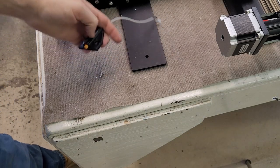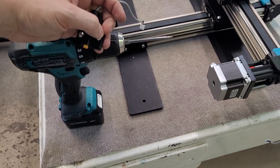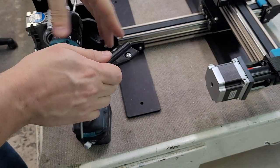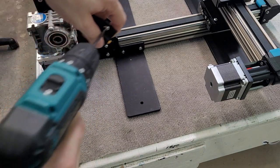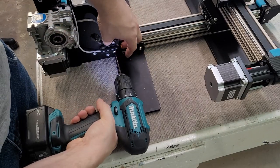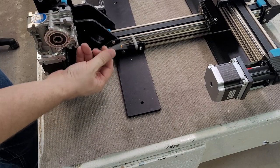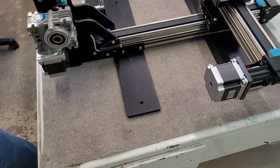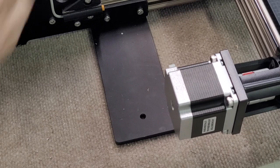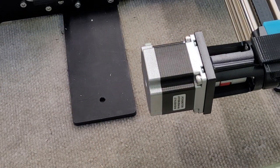All we have left is to put the Y-probe back on. This is a plastic cover, so if you are using power tools make sure you do not tighten these too tight because it can crack the plastic. Start both screws. If the wire got disconnected, make sure you plug the Y-probe back into its proper connector. The Y carriage should now be very far away from the top of the leg of the machine.